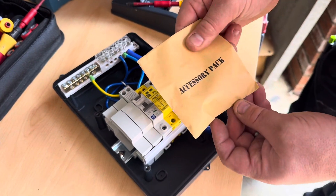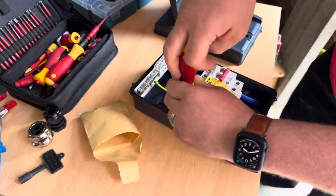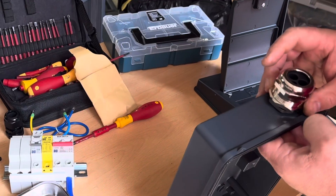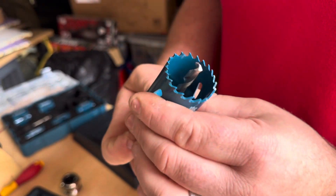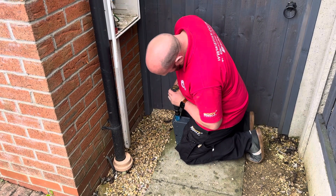I'm going to take out all the stuff on the DIN rail as I need to drill some holes in for the glands and I don't want to damage anything. I have gone a little overkill and I've opted for this stainless steel gland for the tails, but you could equally use any other suitable gland. This was just for me as I've not used one yet.